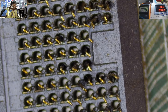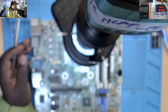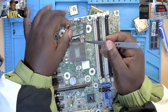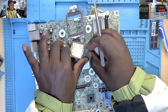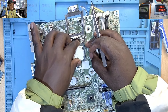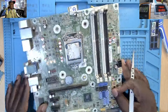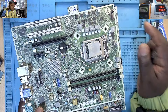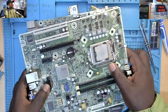I think we are learning a lesson here: you have to be very careful about who you choose to service your laptop. These are cases we cannot help. Removing the whole CPU socket and replacing it with another one is not a simple process — it's very tedious and may be very expensive. The only way now is to get rid of this motherboard. Maybe the processor is okay and not shorted, and you may be able to use it on another machine in future. But these motherboards with broken pins — there's nothing we can do. As I was trying to tell you yesterday: service your laptop or PC regularly, and make sure you take it to somebody who has got the experience to do so, or you'll end up with a dead motherboard.